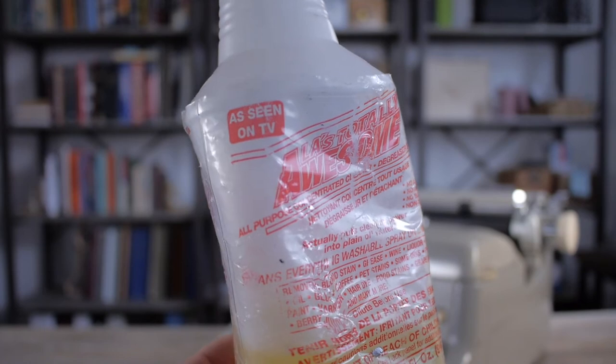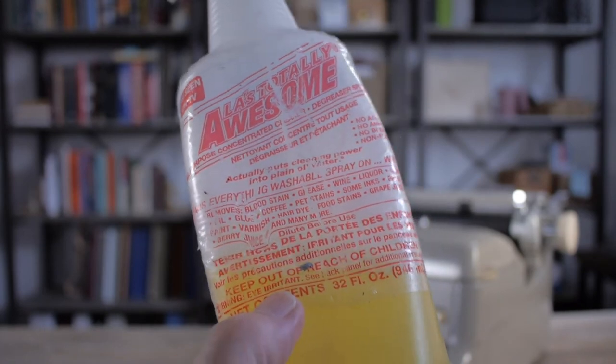I even took a spray bottle of degreaser stuff that I get at the Dollar General store, and I sprayed some of that in the segment and worked it really good, and then wiped it out. I flushed it with alcohol, and then I used a hot heat gun to dry it out real quickly, and that seemed to actually help pretty good. So since I've been testing it the last day or so, it hasn't had any problems anymore.